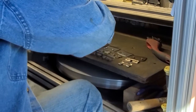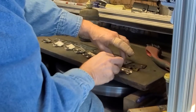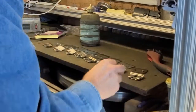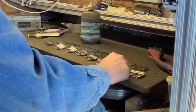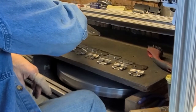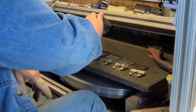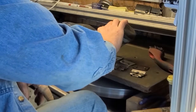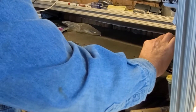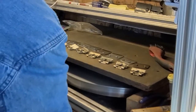Come back. Set all of my blades on the guides. Meanwhile, I'm pushing the sockets all the way back to the back side of the spring. Okay. I put 4 drops of oil on. 2 towards the middle, that way it doesn't kind of push out to the ends. So all the cutters are getting 4 drops of oil. One process all the way through, another process all the way through, another process all the way through. Okay. So it's very systematic.